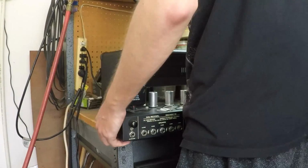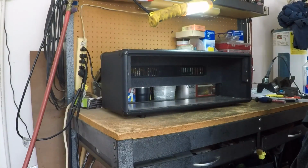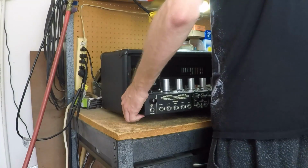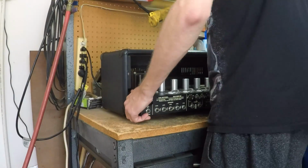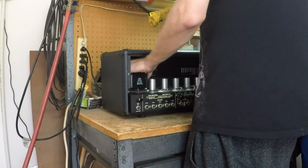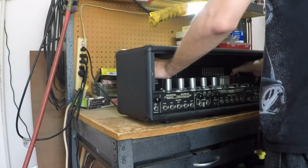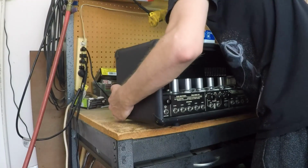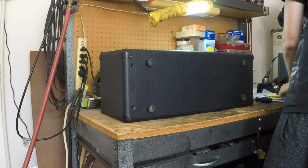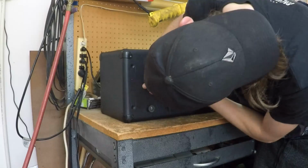Note that this mod requires that you have a patch cable connecting the send and return jacks at all times if you're not using any pedals in the loop. When setting the effects loop knob on the back of the amp to the FTSW, standing for foot switch selection, the FX button on the foot switch will act as a kill switch when disabled, when the light is off. The channel assignment will work, but will mute all other channels than the one selected. Otherwise, the on or bypass options should be used.